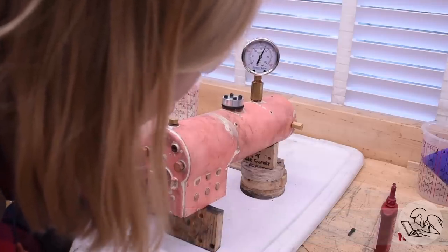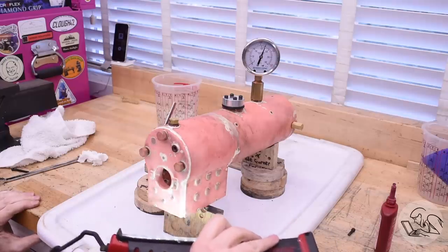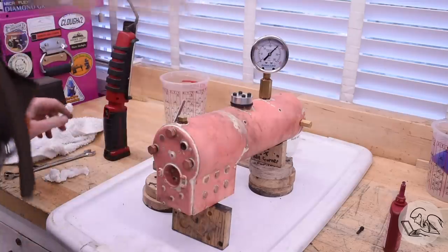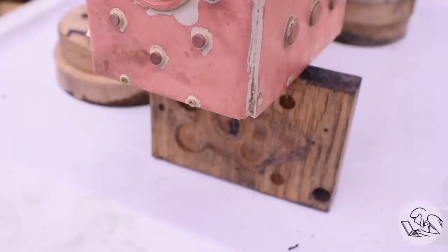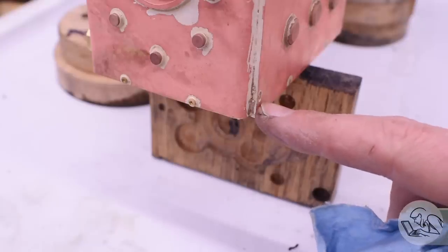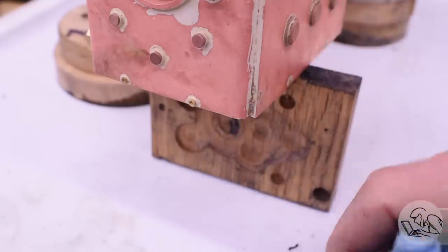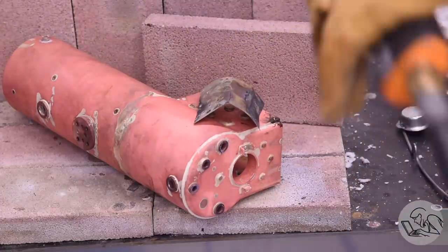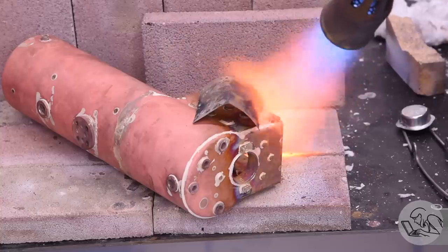With that blanking plug nice and tight, I managed to get up to 175 PSI and things are looking good. It's still bleeding down a little - I've got something leaking in this corner but I can't tell where it's from, so I'm going to go up to 200 to make it more obvious. After a while I found it: way down in the corner, that little brass fixturing screw. A little drip forms right there about every 10 seconds at 200 PSI. A little drop of solder on the fixturing screw and I just need to flow that solder to caulk the area over top of the screw.